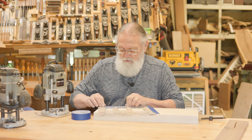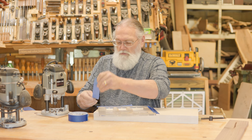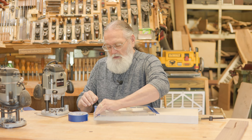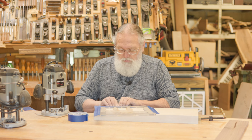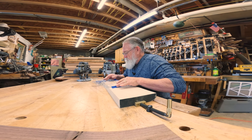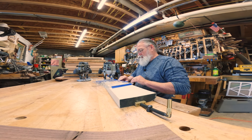We've got a pretty narrow piece of maple here with a crack in it. I'm going to tape everywhere I have an opportunity to contact the board. Let's go across the end and tape that down — as best we can — and I want that to be real stable. Putting that tape in at an angle, not going straight into the corner, gives me a chance to run back across there and force that tape down, making my piece real solid and stable.